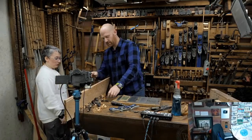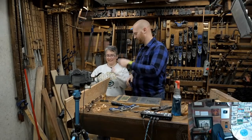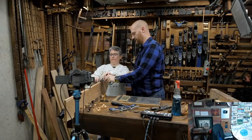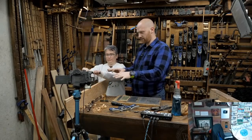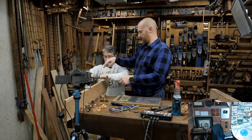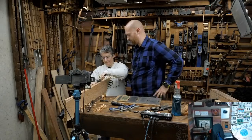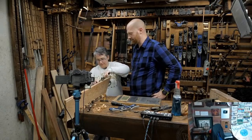Okay. You sure I don't need my stool? If you want to grab your stool, go for it. But here, you can use this. Now, put your thumbs on the flats on the back. Now, like this. So your thumbs go right up against the blade. Slide your index finger closer to the blade, and think about pinching it between your thumb and index finger. I think the BB Spokeshave will fit better. What am I pinching? Like right here or back here? So just think about holding it with those two, the finger and thumb. Like that? Yeah. And then set it down flat on the surface. Now the bed flat, and then push it forward. Just like that.